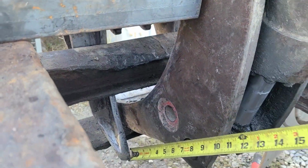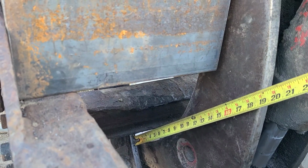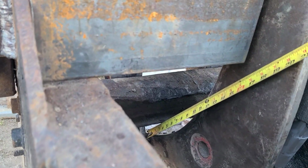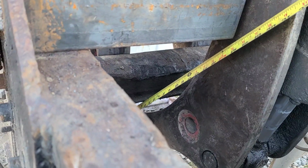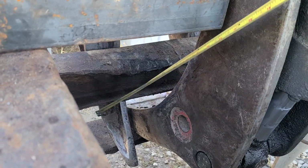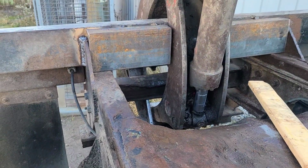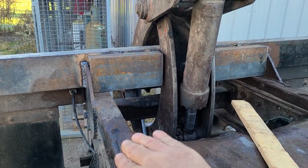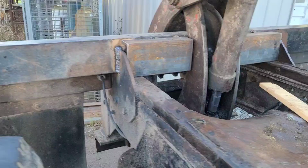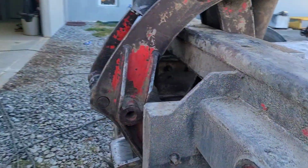And the next thing I'm seeing, if I had something that could go all the way down, like 17 inches down, and weld to that I-beam right there, that would grab a lot of surface down through there, and tie that I-beam and these pieces of angle in together.